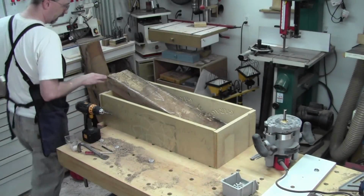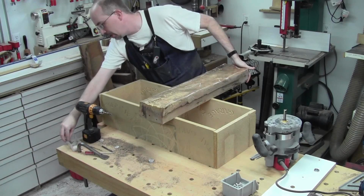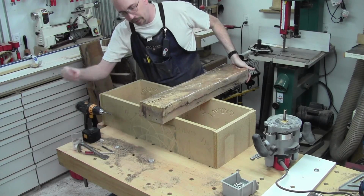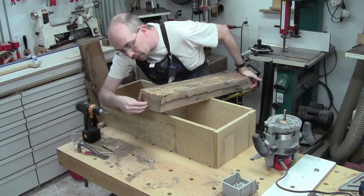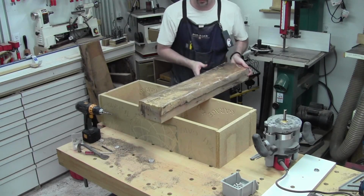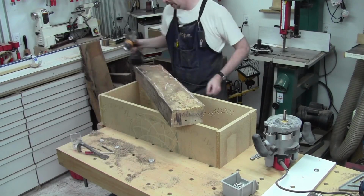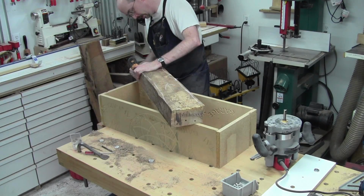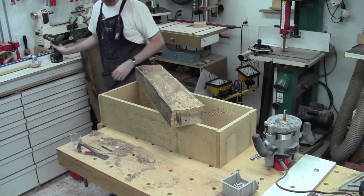Okay, so I did a little tiny counter bore in those as well, so that I can throw these, they're called dowel points. These dowel points go into the hole, and you can use them to locate the mating piece, the hole in the mating piece, and it makes a little divot so you can drill your pilot hole there. And so we're going to do the same on this one, on this end. It's just a 1/4 inch hole, about a 1/4 inch deep. Doesn't take too much. It will not affect the lag bolt's ability to grab in any way, so that's good.